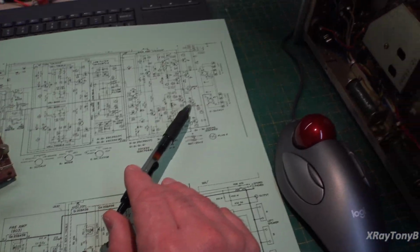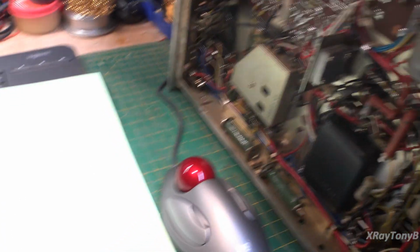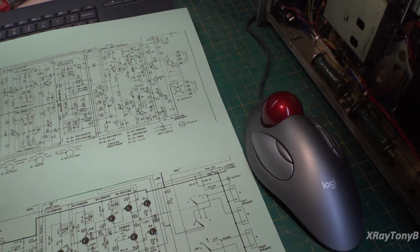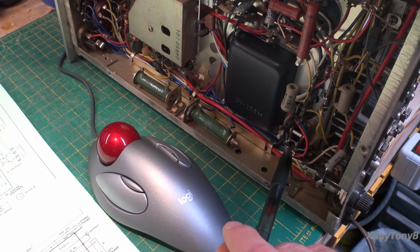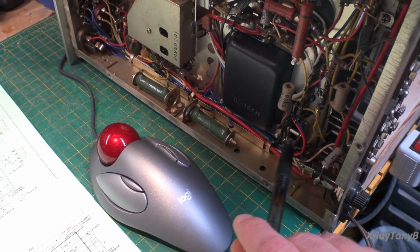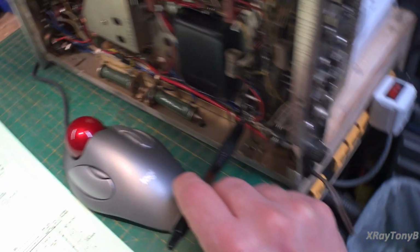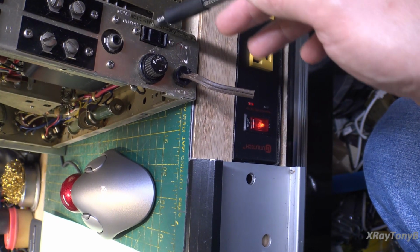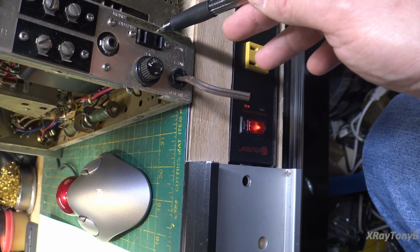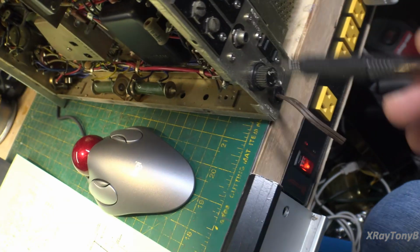And nowhere in this amplifier do I see that jumper. Now what I do see, right down here, is a switch. I don't know if you could see it right there. That's a switch, and that is for the mains. So this is capable of 120 or 240 volt mains. And in fact, looking at the rear of the amp now, I see this sticker that says that it will do 117 or 220, 230 at 50 or 60 hertz. So that explains that part.